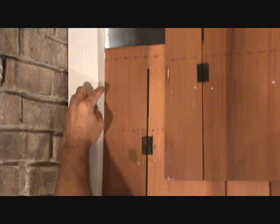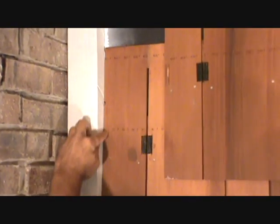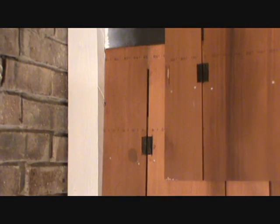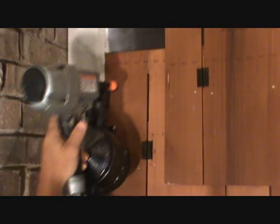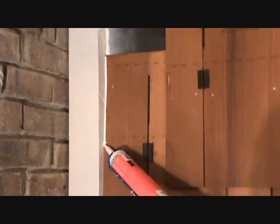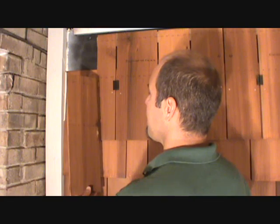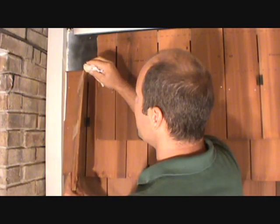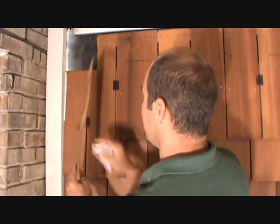To make sure your joint at the corner board is weatherproof, you'll want to caulk the joint for the upper portion of the shingle that won't be seen. Applying the caulk will work better if you add one more nail to the top edge of the shingle to hold it flat. Before you install the last shingle, apply your finish to the cut edge.